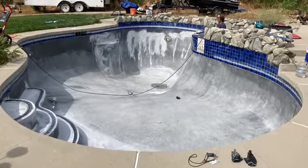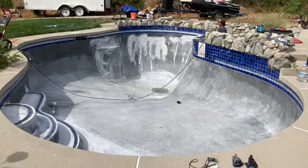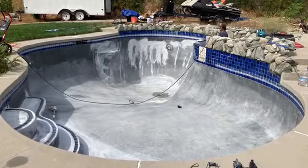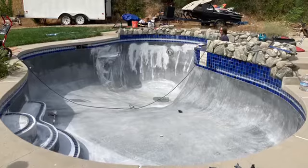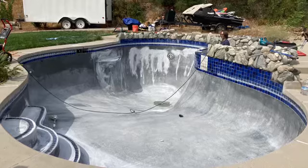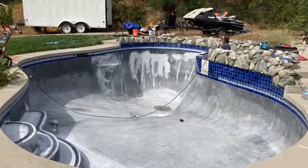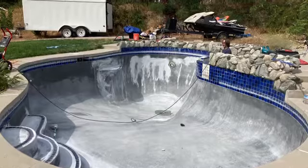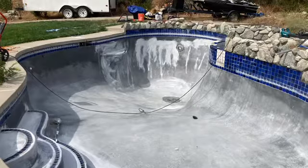After you have initially acid washed the entire swimming pool and removed any leftover algae and or water, you want to make sure that you cover up any holes and or cracks that may have been discovered on the floor surface or the walls. Personally, I use a product called Pool Patch, which you can also find at Leslie's Pool Supply store. It is a thin mixture of cement and other catalytics, which applies directly over the cracks and or the holes of the surface of the pool.